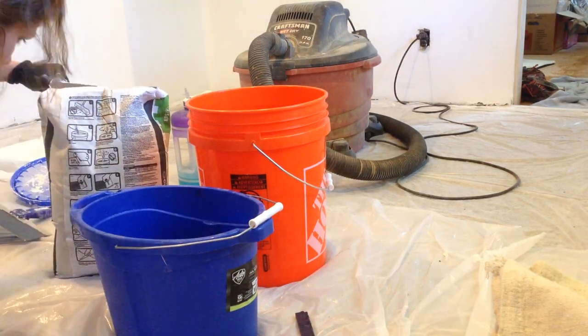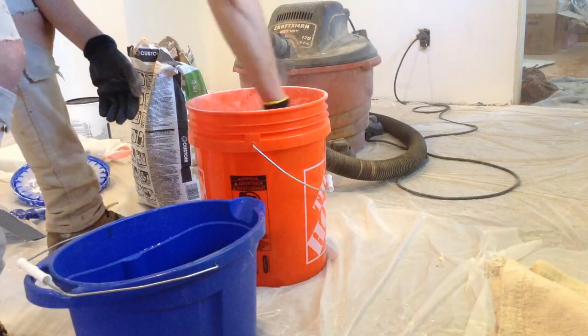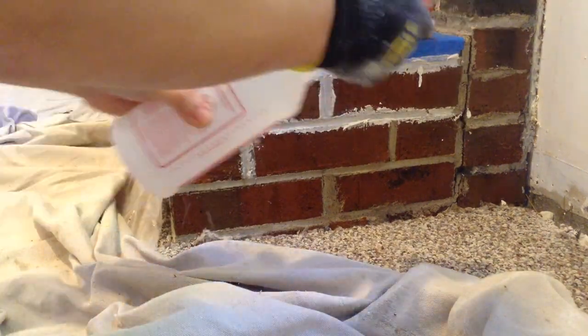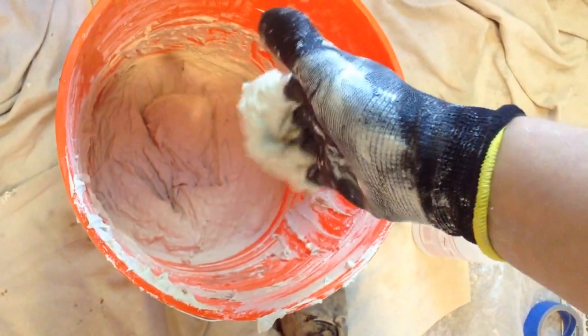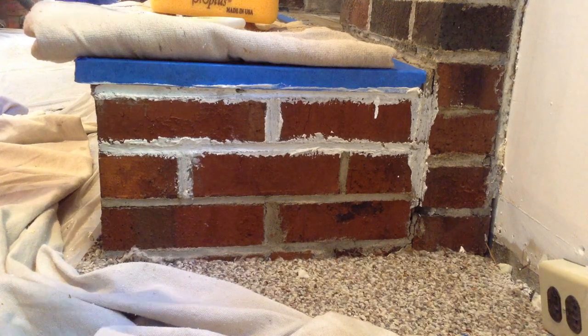If you've never mixed cement or mortar before — when adding liquid, I like to do it gradually, especially since I'm not mixing the whole thing at once. I get it to the consistency of creamy peanut butter — when I pick up a spatula or putty knife, it should kind of stay on there. Another tip: you want to wet the brick before you start. If not, the brick is so porous it's going to pull all the moisture out of whatever you're putting on. You can see it's like creamy peanut butter — when I hold it on the edge of my hand it doesn't really fall off, it has a little grip, it's not super runny.